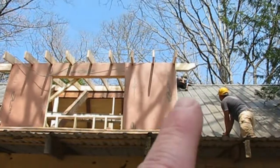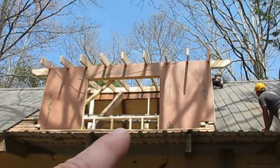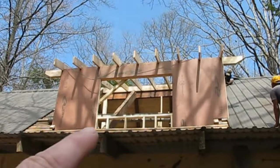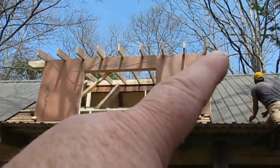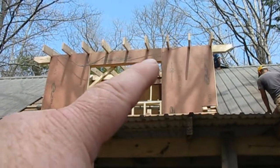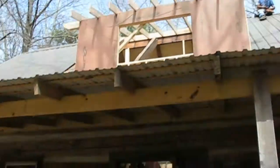We had to raise up our header because of all this thickness down here. So what I came up with was building in a barge hanger into the top of the wall to compensate for where we raised our header. That's going to turn out pretty cool. Let's go see what Eric is doing.